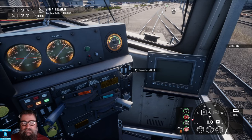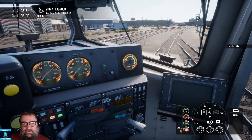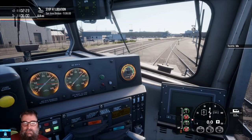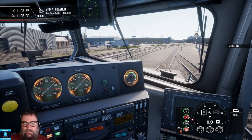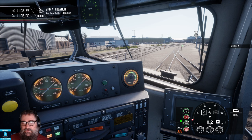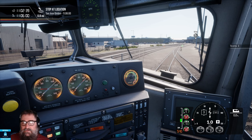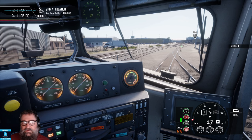This time I'm going to put the gen field on, now that we're back down low. What you'll see on this gauge here — it shows braking for the dynamics and powering for when the locomotive is pulling the train — see the needle start to move. We're now generating power. So with engine run and gen field on, we're actually generating some power and you can see what's happening here — we're starting to move off.